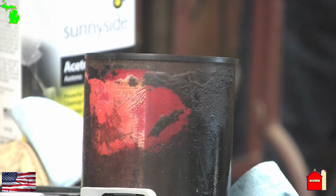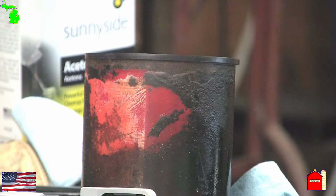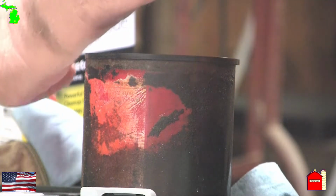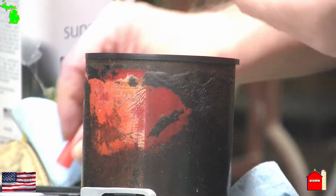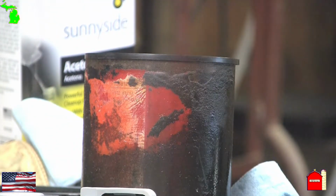So I glued the gasket in place by first gluing one spot and then gluing where the gasket bulged a little bit so that it was still on the edge of the cover. I took my time and slowly worked my way all the way around the cover so that the gasket would stay in place. After I had compression on the gasket, I didn't care if the glue failed. The compression would hold everything in place. It was holding the gasket in place strong enough that even normal handling did not dislodge the gasket.